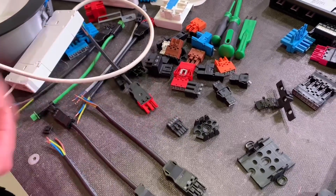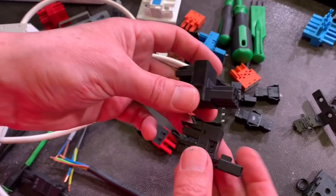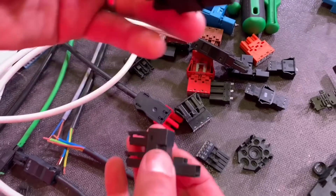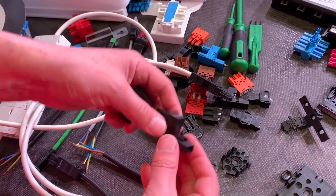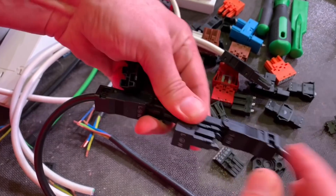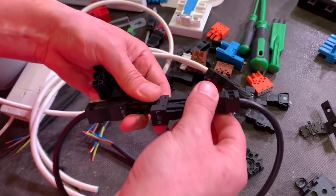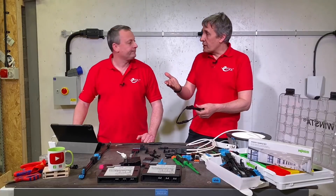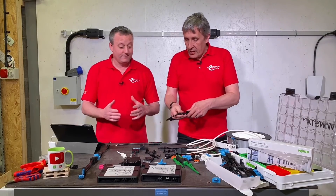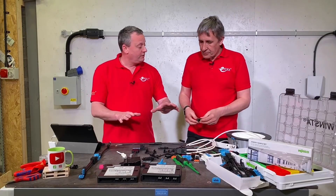In contrast, the mini range has only one wiring termination per pole. The second distribution option is a distribution block — bringing power in with multiple outgoings. There's a version for the mini and one for the midi. They click into place and can go off to the next fitting or downlight. Multi-wire versions are available, including some with a switching block so you can run a wire down to a conventional light switch and back.